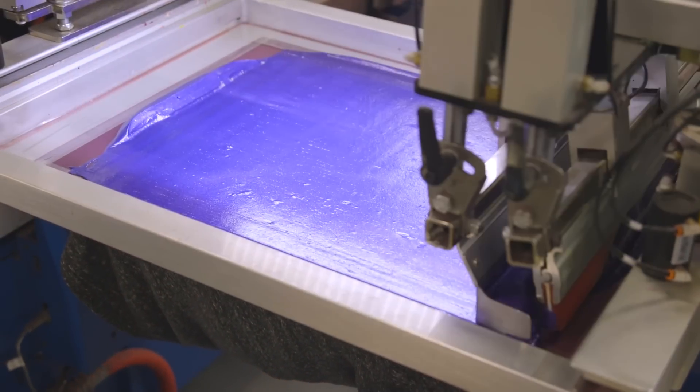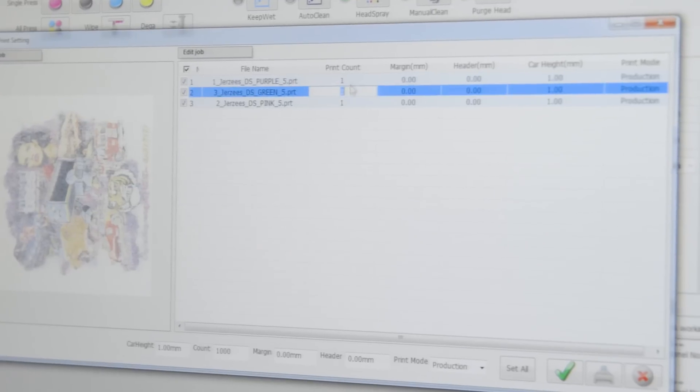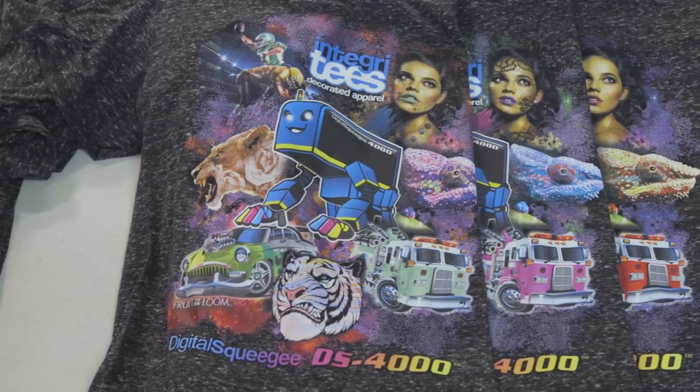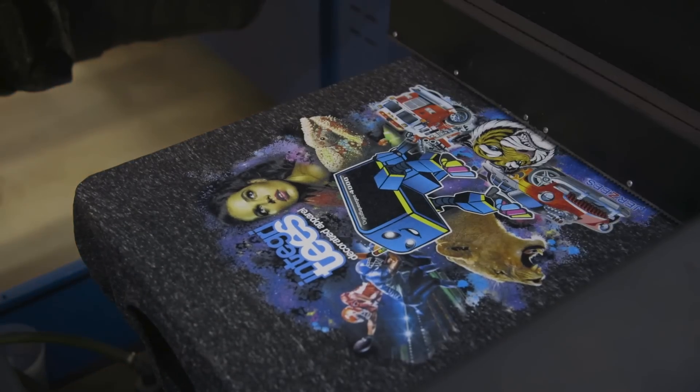How can somebody use this for better versatility? One thing the Digital Squeegee offers is variable data — in layman's terms, that's basically using the same base screens. Say we print a white rectangle with those screens. The CMYK print can change from 1 to 100, so you could put a cheetah on one, a photograph on another. You can change the art every single shirt and have infinite artwork. We're going to show variable data with three prints being printed consecutively, and you'll notice different color changes and different textures. Historically DTG isn't good with polyester, so we'll show you that high polyester cotton fabric like the snow heather blend can get really beautiful high quality prints with the Digital Squeegee.